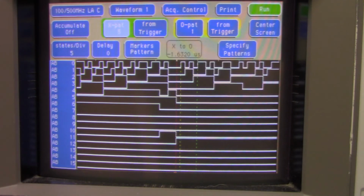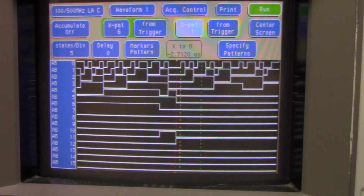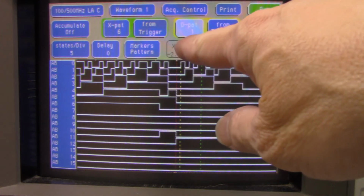Yeah, you can have different markers and move them around. So the red line is where it started, and you could see this is address 800 here. So sometimes it'll come up with the data also, but you could see like the 8, that's the 1, that's 8. If you go up here, that's 801. Sometimes, let's see, if I change something a little bit here, maybe I believe it was this one here.